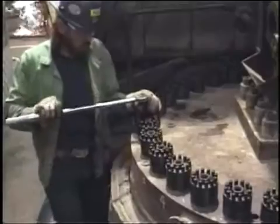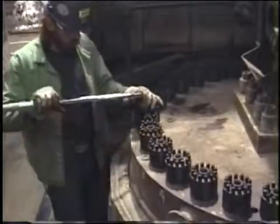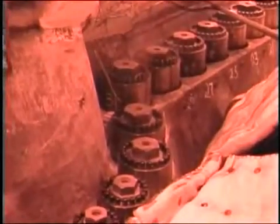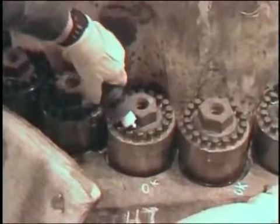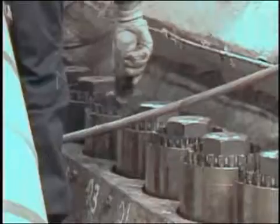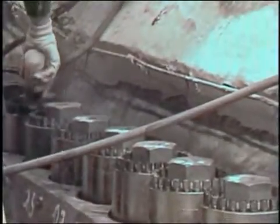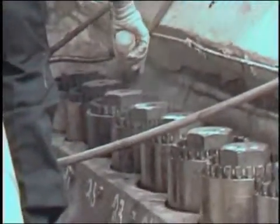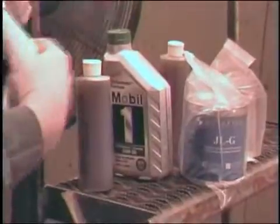However, if a torque wrench is used for removal, some manufacturers say that the tool will be less accurate for tightening. For service at elevated temperatures or in corrosive environments, apply oil to the jack bolts prior to removal. Apply the oil while the bolting is still hot. Petroleum-based oil can be applied up to 300 degrees Fahrenheit. For bolt temperatures of 300 to 600 degrees, synthetic oil must be used to avoid smoking.